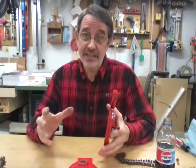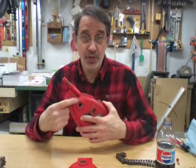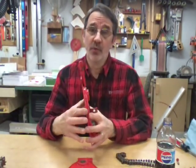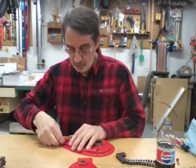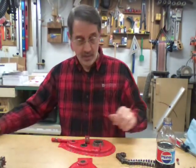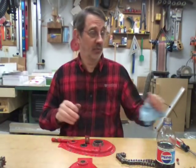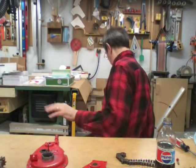There are some things you have to do or it's gonna leak on you. The first thing I always do is these little vent holes — for some reason they put them in there — I weld them shut. You can see I got some of the paint removed. I gotta finish getting that paint off because if you don't, that's really gonna mess up your weld.